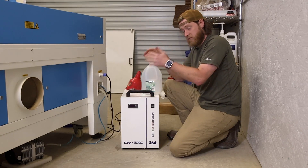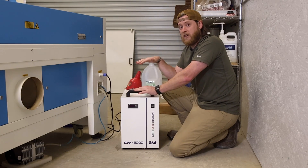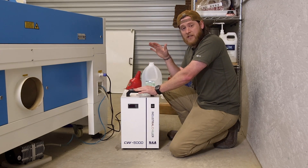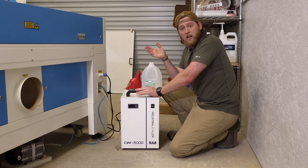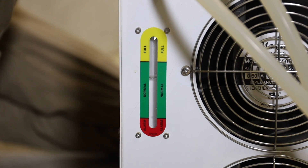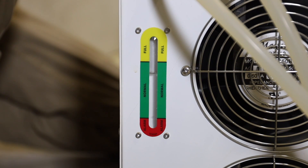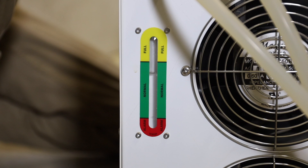With that finished, we can move on to refilling the chiller. Depending on your ambient temperature or if you are ever below freezing, you may need to add some antifreeze — there is a link in the description for more information on type and amount. To fill the chiller we use distilled water. Each size of laser requires a different amount; we have a Nova 51 100-watt laser and use one and a half gallons. Take a funnel and fill the chiller while watching the gauge on the back, filling up to where it starts to be visible in the yellow full portion. Then plug in your laser, turn it on, and watch the gauge to make sure the water level stays in the green normal portion, filling more if needed until it stays constant in the upper half of the green.